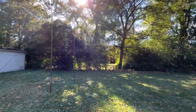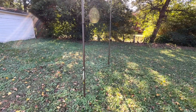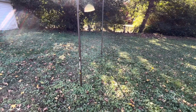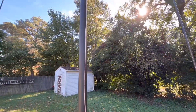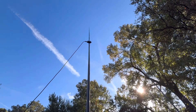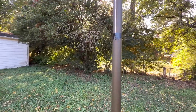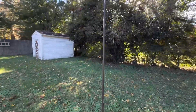Okay, here we go — another backyard antenna experiment. These are my two DX Commander 7-meter poles. Before I put them down, I have a couple of 3-quarter-inch PVC pipes, about four feet — a little over a meter long — that I drive in the ground and then slide these onto. Got it measured out to the proper distance. On it, I have 16-gauge speaker wire going up to an LDG 1-to-1 balun, and then the other half of the vertical dipole — the driven element — is there. And then over here, the other identical DX Commander 7-meter pole with the director properly attached.